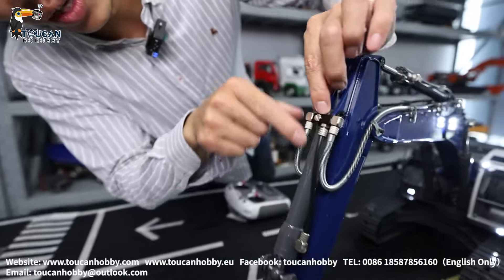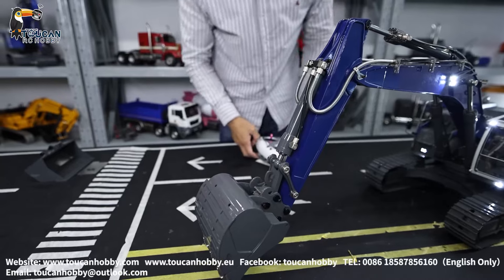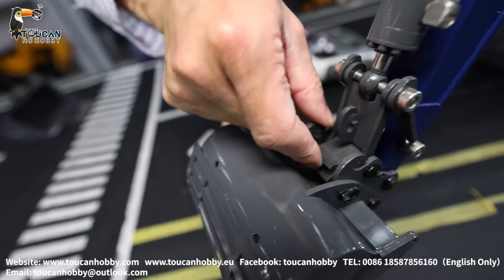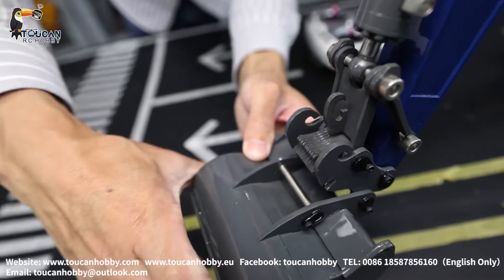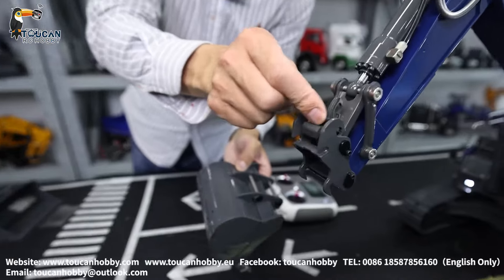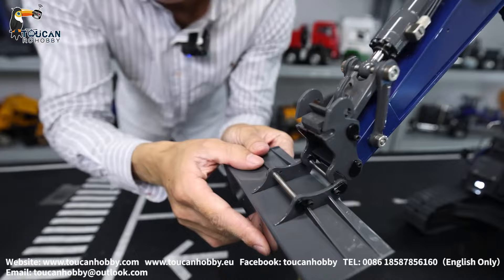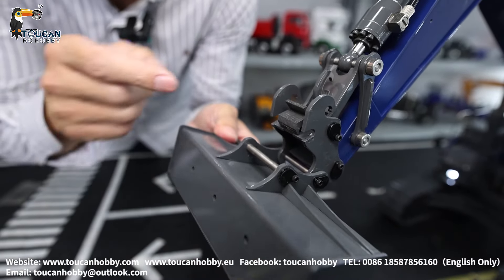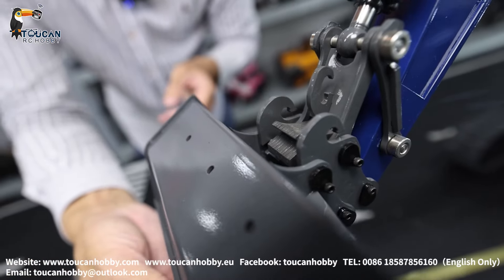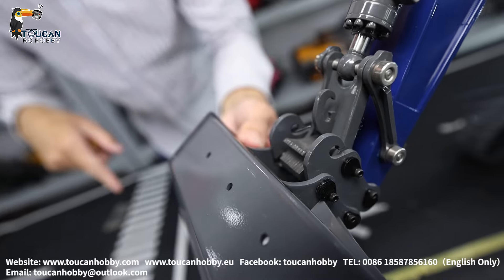Because this oil goes inside, pushing it, and the bucket is doing the digging mode. And here is the push button for manually releasing this bucket — I have to lift up a little bit. This one is the hook. Actually we can change this one — hook from here, lift up, lock it, and take it out. That's the manual hook.